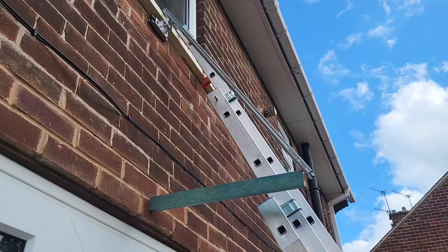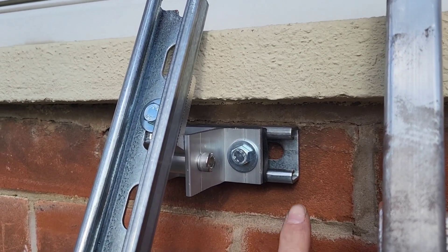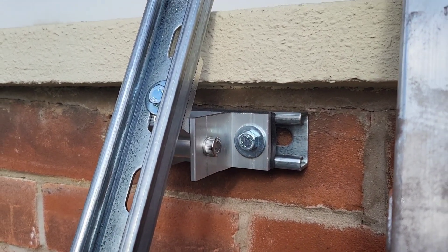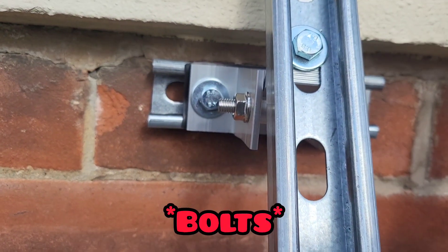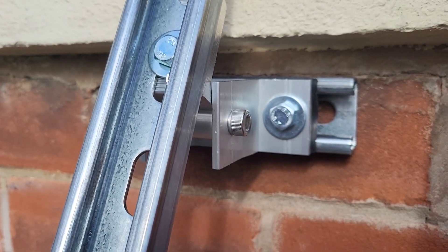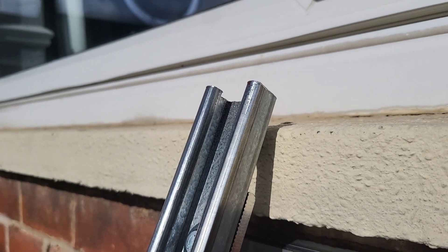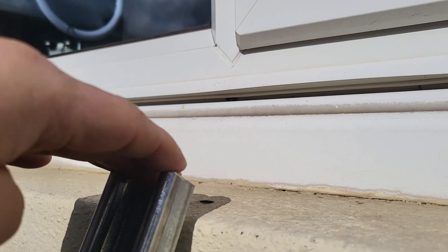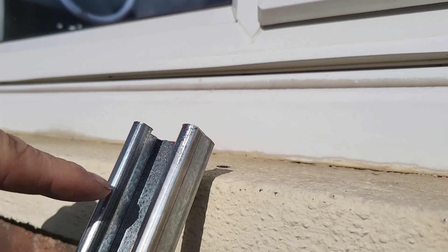Just a quick look at how I've mounted it — I've used a length of uni-strut that I've roll-bolted into the wall, and onto that I've just put two nuts, one either side, with some spring clips just to fasten the bracket on. That gives me the clearance I need to miss the top here, and I've still got plenty of clearance to miss the window.